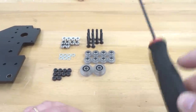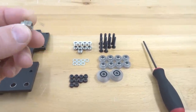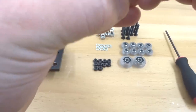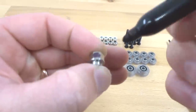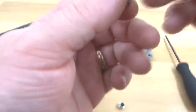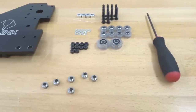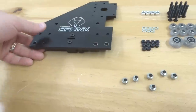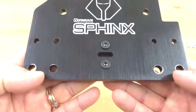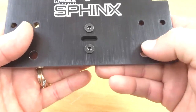We're also going to need our ball driver and permanent marker. We're going to take our eccentric spacers with our permanent marker and mark the etched 6 millimeter sign on the eccentric. The purpose of doing so is while we're adjusting our eccentrics to add preload to our rail, we want to have an indicator to know how much we need to put on or take off. Mark each one of these eccentrics. As you can see, we have four holes at the bottom that are slightly larger than the top — these are for our eccentric spacers so we can make that adjustment and add preload to the wheels.